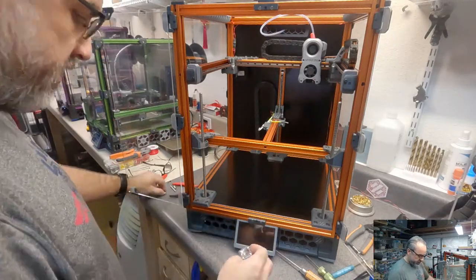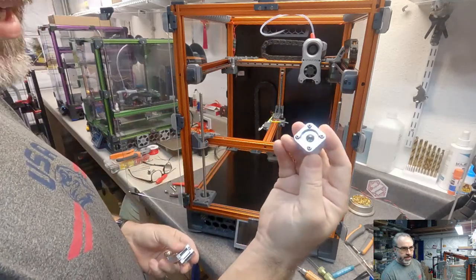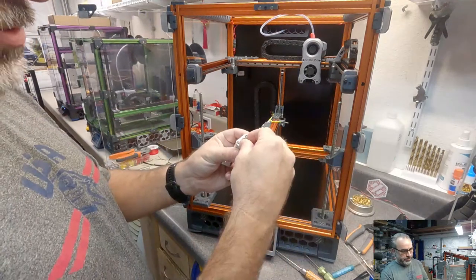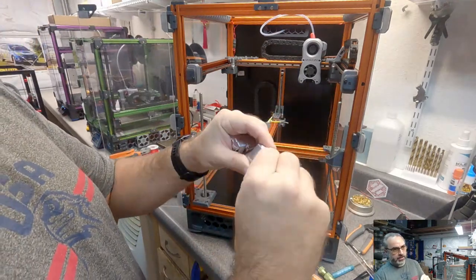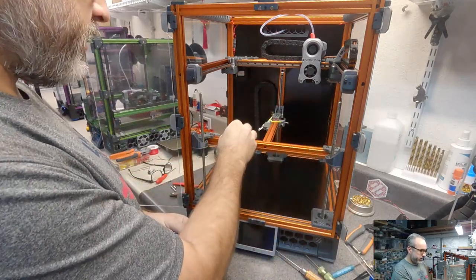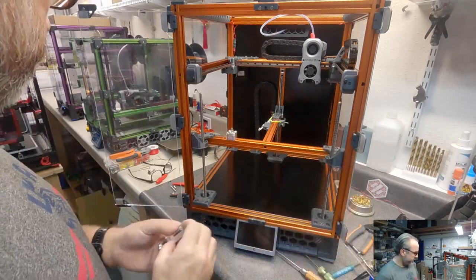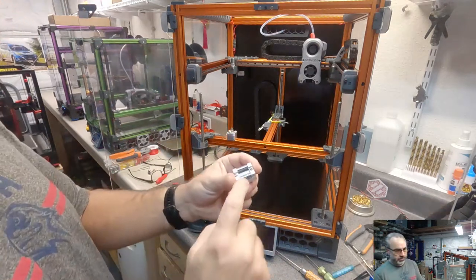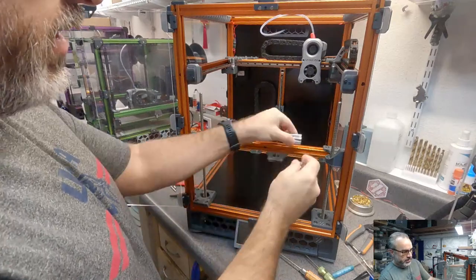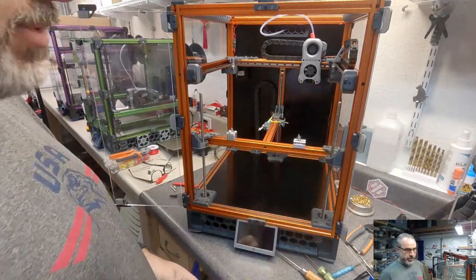The Mandala mount system consists of three main parts. There's a fixed point, and this is fixed in that the ball mount goes into that countersunk hole there and fixes that in place. We're gonna put that one, I think, over here. There's a sliding mount, it restricts movement in a single dimension and allows movement in the other direction. That's going to go there, and then the ball mount rests in there.